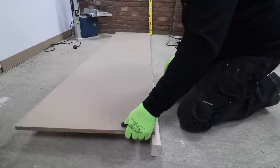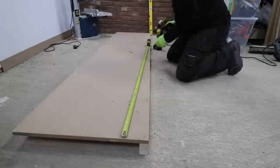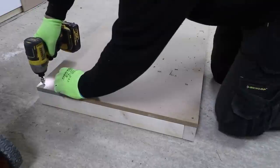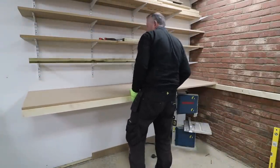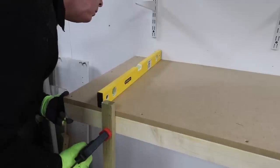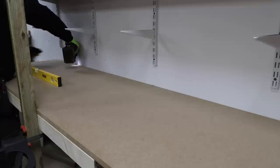This first side I don't bother cutting down - this is exactly eight foot - and from the top I screw the 3x2 batten to the underside of the MDF, which makes quite a nice strong front face. With another length screwed onto the side this will give a good bearing for the legs to support the bench. With the bench level using some temporary legs, I can now screw it in from the top into the batten that's on the wall, which gives it quite a lot of strength and support at the back.